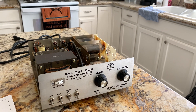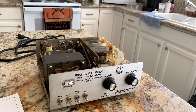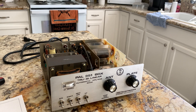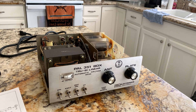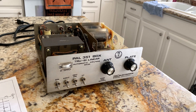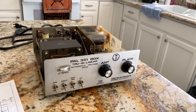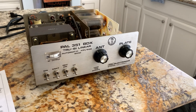I've got some stainless steel wire and I'll show you that in a minute. It's going to be fed with some 300 ohm ladder line — I wanted lightweight 18 gauge stuff — and it's going to come down to a 4:1 balun at the remote antenna tuner. I'm going to have one coax running; the tuner's going to switch between the vertical and the multi-band 20 meter dipole.